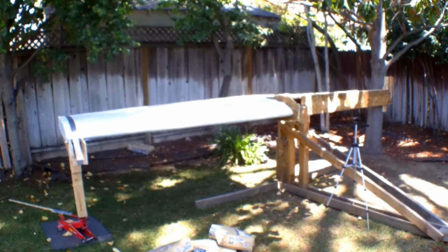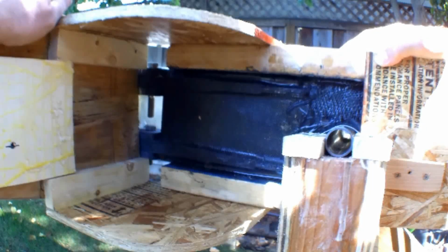The test section of wing does not have any sweep because that is not a critical factor for the components I want to test. This next photo shows the center section of the test rig where the wing attaches to the counterbalance beam. What you see here are the attachment fittings and the two 1/2-inch diameter bolts that attach the wing to the counterbalance beam, and you see the fittings on the counterbalance beam that the wing attaches to, and you see a pivot tube. It's a 4130 chromoly piece of tubing that goes through that counterbalance beam and sits on the test stand and allows the structure to tilt back and forth teeter-totter style, and that puts the test stand strictly in a down load only, so there's no bending loads imparted to the test stand.